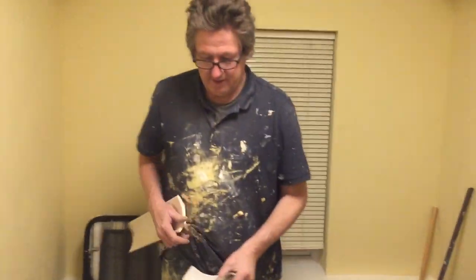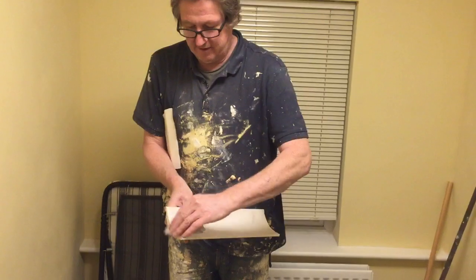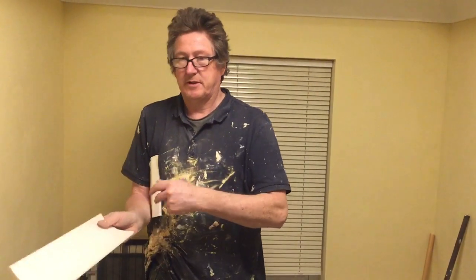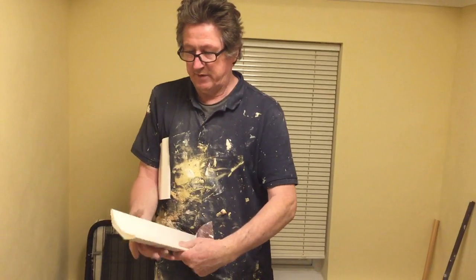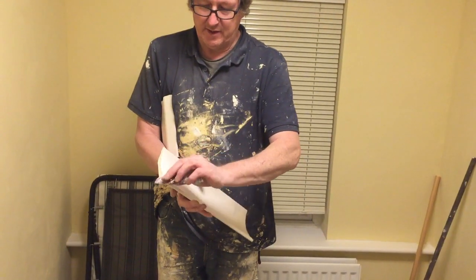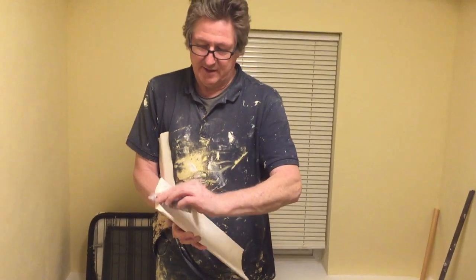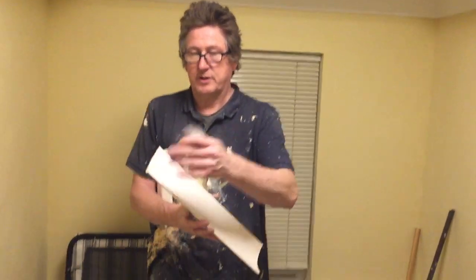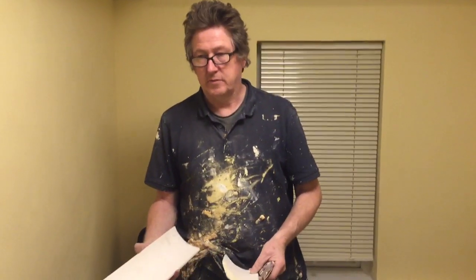What I do is a little bit of sand and stick it up. With this stuff, if you need to join it — a lot of people say go at an angle — but if you do a bit of bevel on each side and push it together with some filler, two-part prep filler, and join it, you will never see the join.